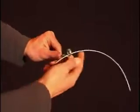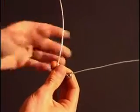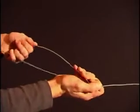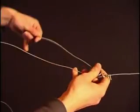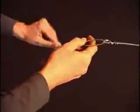Insert the wire end through the first eyelet and proceed towards the second eyelet on your right. Begin with a length of approximately 160 millimeters or more and fold it back. This end forms the first leg of the joint, which is bent to the front from underneath the joint and bent over to be tied later.